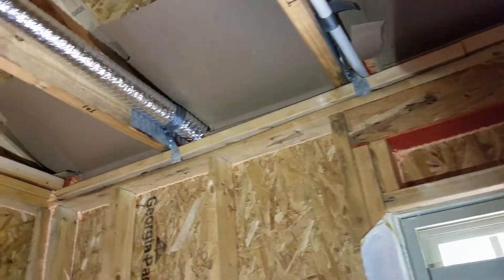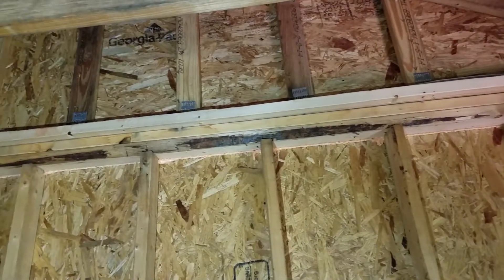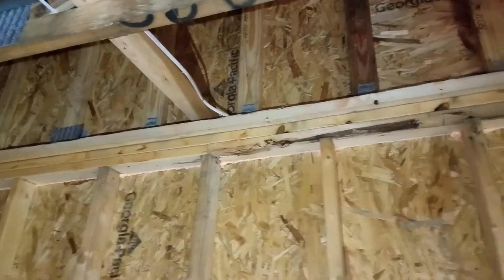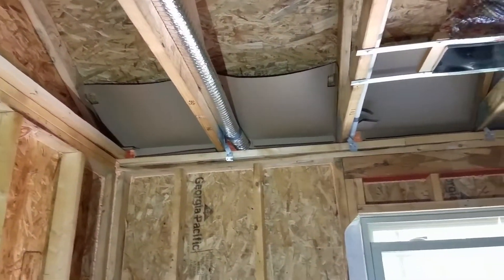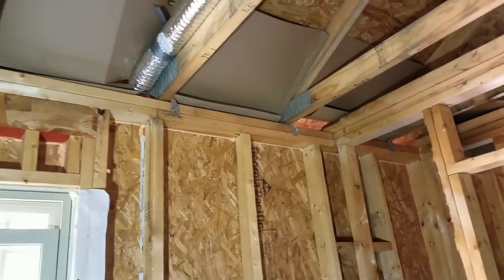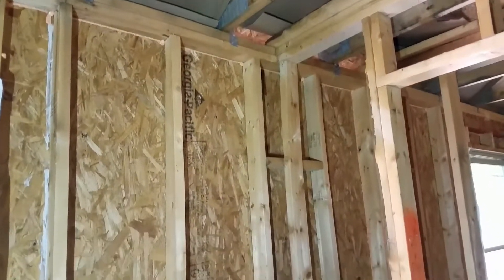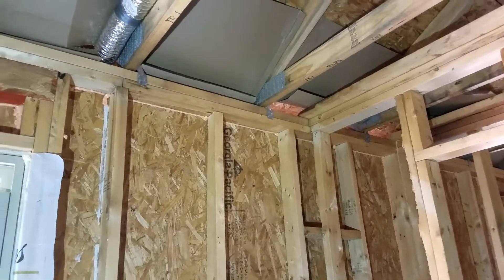That's how it's done. Here's a side wall, and we saw outside how the sheeting was used to tie any floor junctions together. There you have it — a basic explanation of the use of hurricane straps and your through-bolts, J-bolts, and straps on the first floor to tie everything together and to secure it for a hurricane. Thank you.